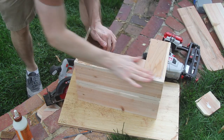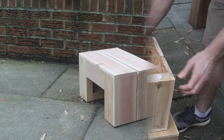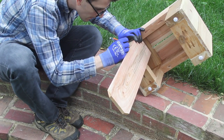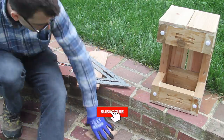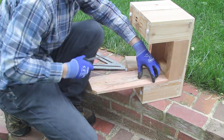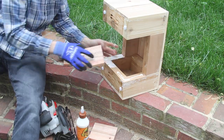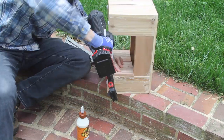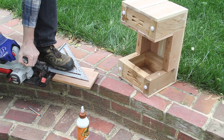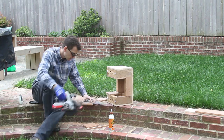After that I did another round of sanding, added some plastic feet to keep it out of standing water, and I thought it was done. However, after living with it for a day or two, I decided I definitely needed to add the inner leg pieces, so I went back and did that. I ran out of slats that were the same width as I needed, so I just cut down another scrap with my circular saw and a straightedge. You can do this to flush everything up at the start if you need to.